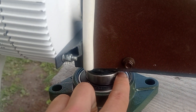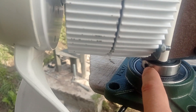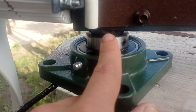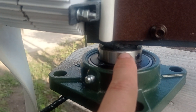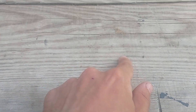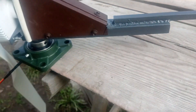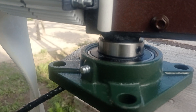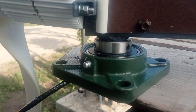The bearing has two connection joints — small cone-shaped nuts. On the pipe — a steel pipe 35mm in diameter — I had to make small cone-shaped holes, not drill all the way through, so these nuts would fit in and fixate it absolutely nicely so it will stay steadily and not move anywhere.